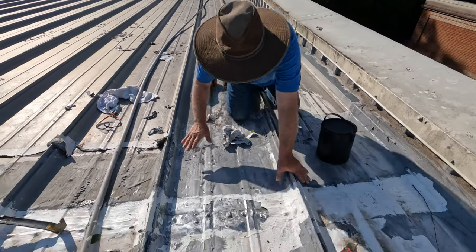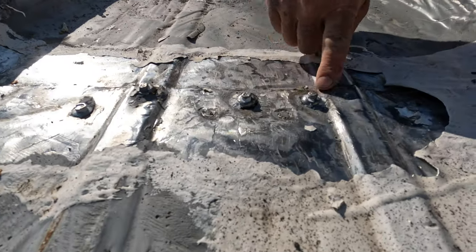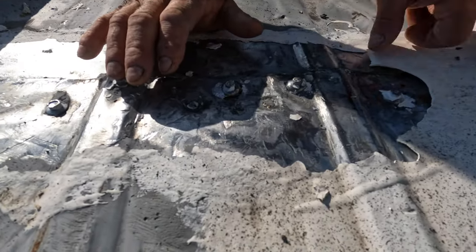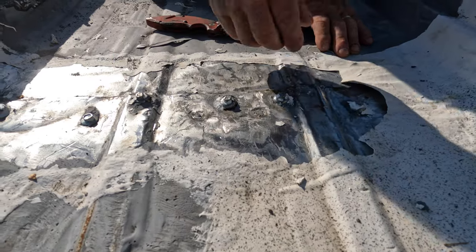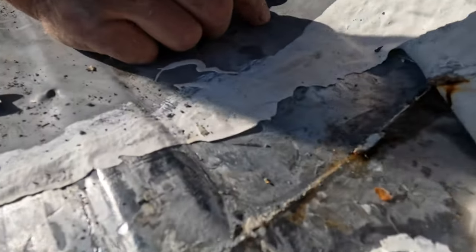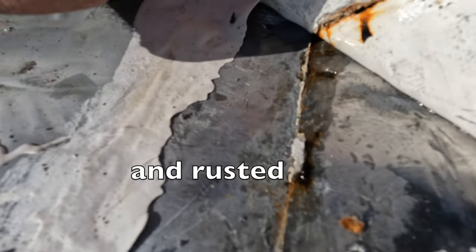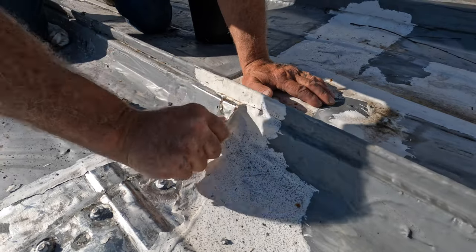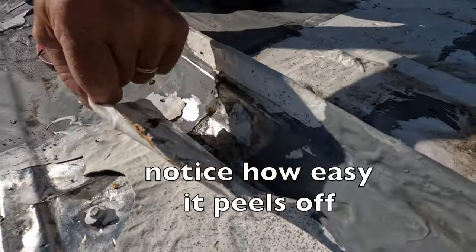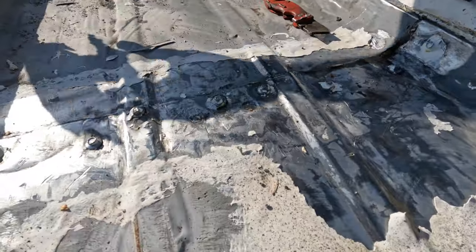This roof slants this way, so I came to the seam and started removing some material, and I found a little bit of water around the screws. We found the leak. I'm cutting away this material — it did not stick properly. They've used some kind of silicone, and look, it's wet here. My fingers are wet. This silicone doesn't stick — look how easy it comes off. You cannot just use any material.